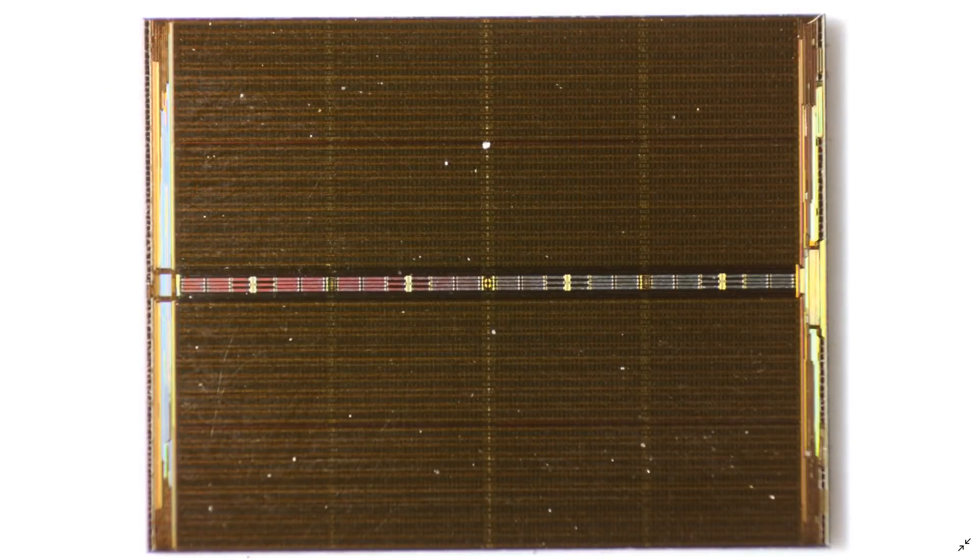Now I've changed the photograph entirely - it's a completely new chip. This is the DRAM. You can see there are IO pads on the sides of the chip. You can see there's obviously a column and row structure here, and banks as well. It looks like there's power distribution probably in the center to feed all those banks. You might ask what DRAM this is - it's easy to find a die mark. It's from a company called Elpida, a Japanese company. Elpida went out of business about eight years ago, and Micron bought their assets. So we're obviously not looking at a really new die.